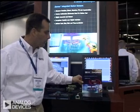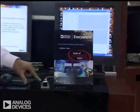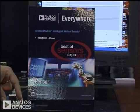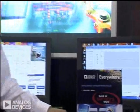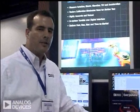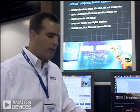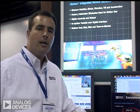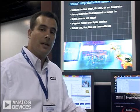The iSensor product line won the Best of Sensor Award in 2007 for the Six Degree of Freedom Inertial Measurement Unit Base Sensor — really a tri-axial sensor. This sensor incorporates a triple-axis gyroscope, triple-axis accelerometer, and at the factory it's calibrated for sensitivity, bias, and axial alignment. Multiple flavors of the product also allow for temperature and voltage sensitivity calibration.